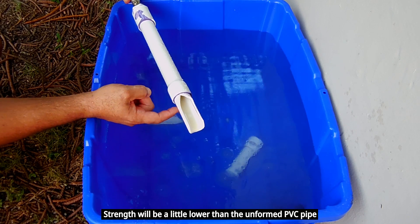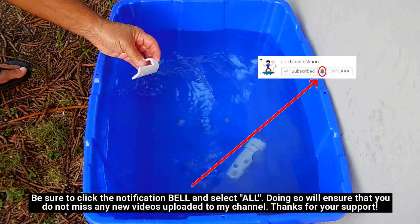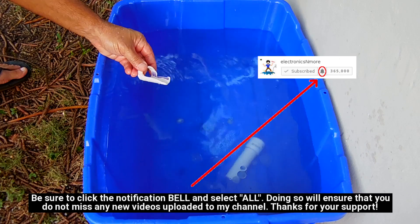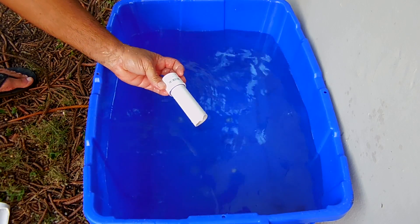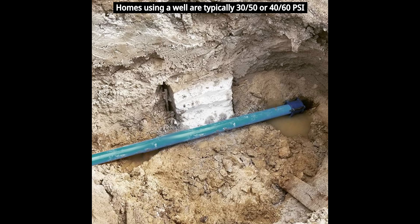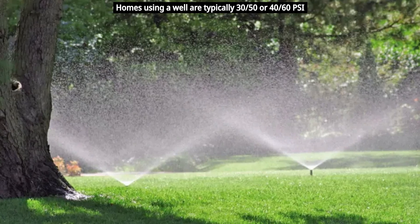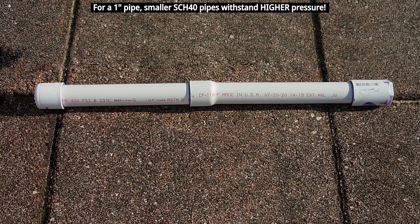So the fitting is very strong if you do this, and I know that personally because I have jobs that I did almost 30 years ago using thermoforming and they're still fine to this day. The thermoformed fitting will do just fine on your city water supply, which can go up to around 85 PSI. Water mains could be 125 or 150 PSI. You have your sprinkler systems. You will not have any problems thermoforming the pipe because you're not going to go anywhere near that 800 PSI or even that 1000 PSI burst pressure.